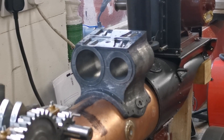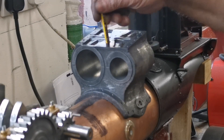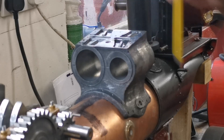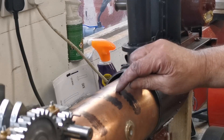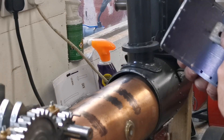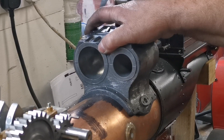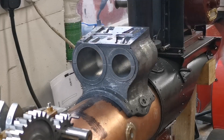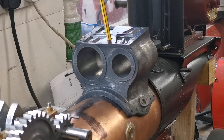There's a little steam pocket there. Get that out of the machine and put it back on the boiler. So that's most of the steamways done. What I'll be able to do is put that pencil through there, mark the boiler, and then where that mark is, put two holes in there as the drawing says — not right underneath there, but at each corner.